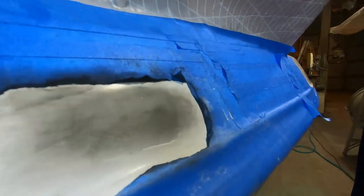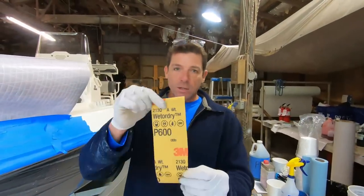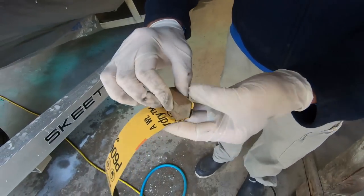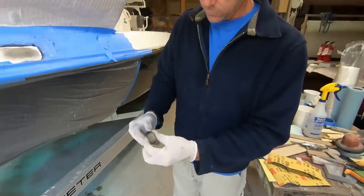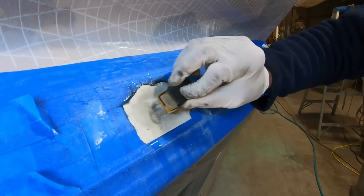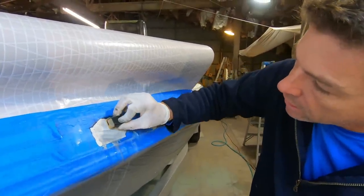If you're new to the channel, we got a whole series of videos — we're boat builders as well as boat repairmen. We're going back with our little blocks but this time moving to a finer grade — a higher numerical number but finer grit. We're going to stay with the small block but using 600 grit. I like to just start the block on the edge, nice and easy, roll it up. Come back with a little moisture — I always like to wet the paper too, that kind of seems to help it keep from loading. Keep the block nice and flat.